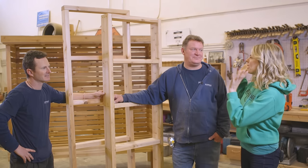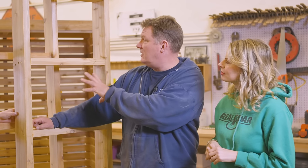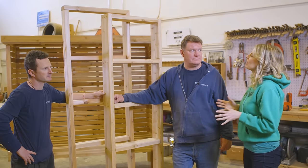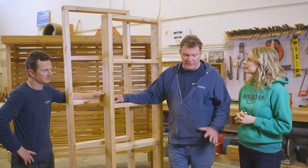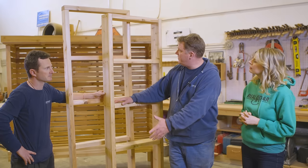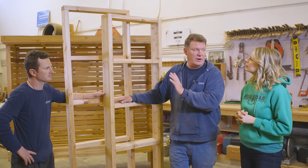The frames for the bench and the canopy are all done. The next step is to take these frames and apply the vertical studs, which will eventually take the cladding. Builders should keep in mind: one, that they're building on an extremely level surface; two, that once the vertical members are up, they're plumbed and braced square and true. For more detailed instructions, go to realcedar.com for free downloadable building plans.